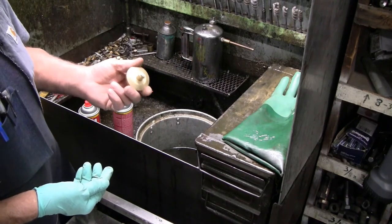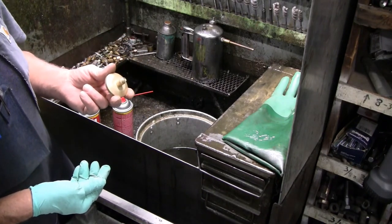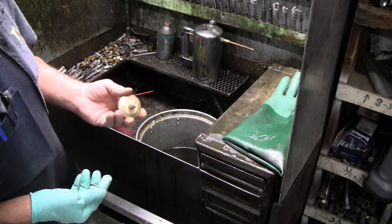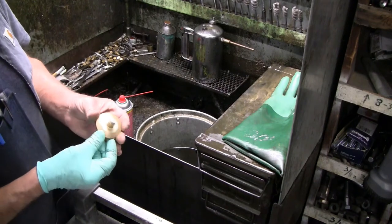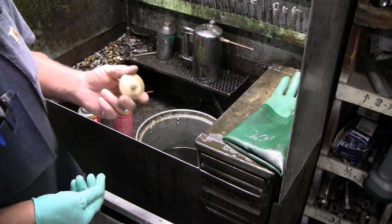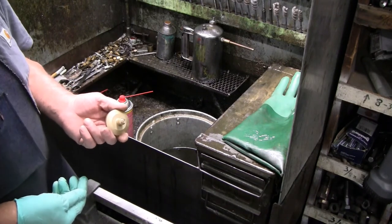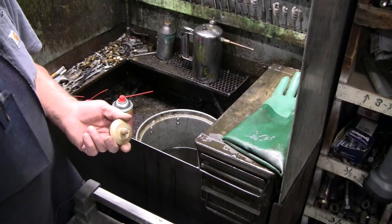good when cured with a proper glue line, which we have here, to in the neighborhood of 4,000 pounds per square inch, which generally speaking means you either have to use heat to break the adhesive down, or in an assembly like this, you'd have to destroy it. You wouldn't possibly be able to get enough pressure on a pusher tool in here to break that bond and push that dowel out. That thing is stuck. It's already stuck, and it'll be even better stuck by morning when we come back to do the finish machining on this project. So we'll shut that down for now and pick this back up in the morning after this adhesive has had time to fully cure.